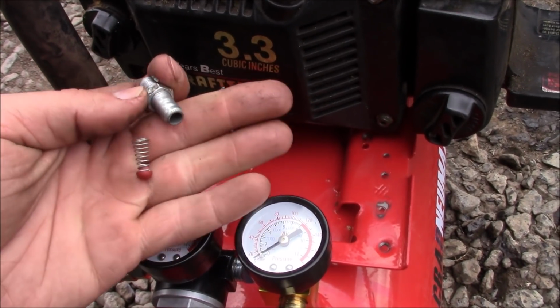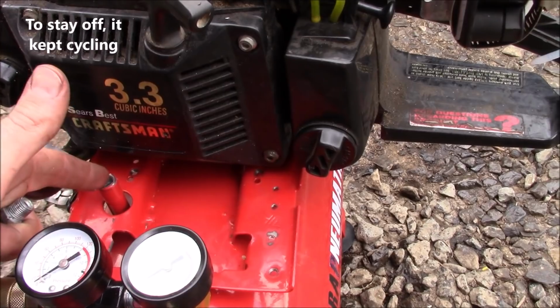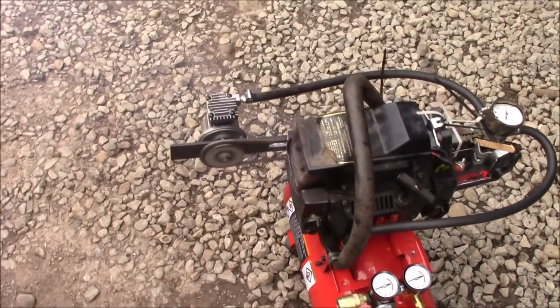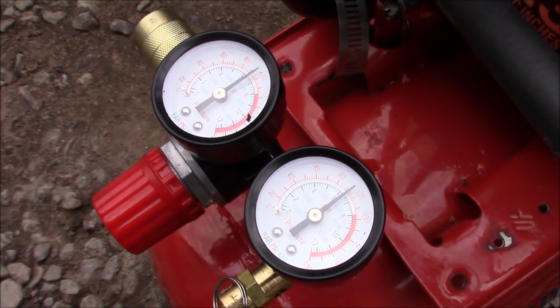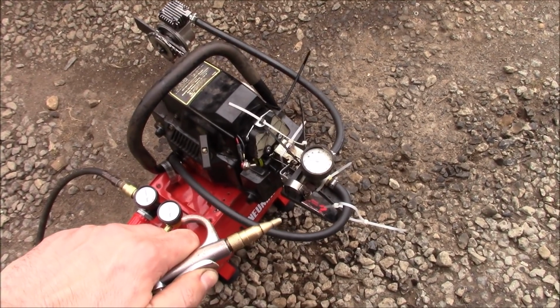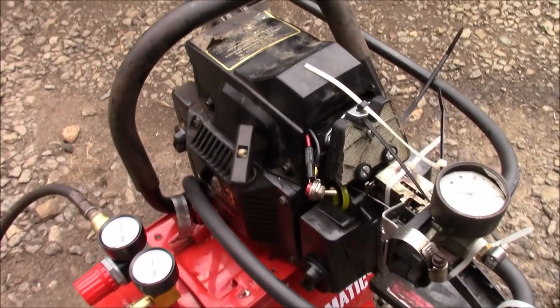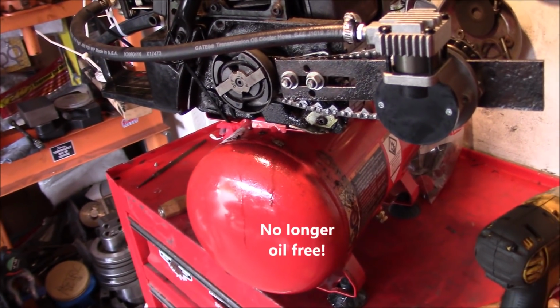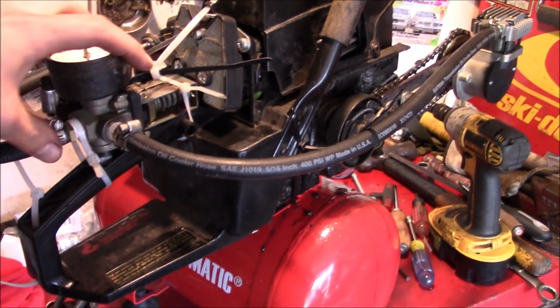Alright, one rolling modification. There was a check valve underneath this inlet, and to get the back pressure out to the gauge to actually shut the chainsaw off, we always need this air coming back out of here. Well, there it is. It does work. So that's a victory. I think we might put on an extra set of zip ties here to make things a bit more permanent. I think we got the idle range locked down on where we want the pressure switch.